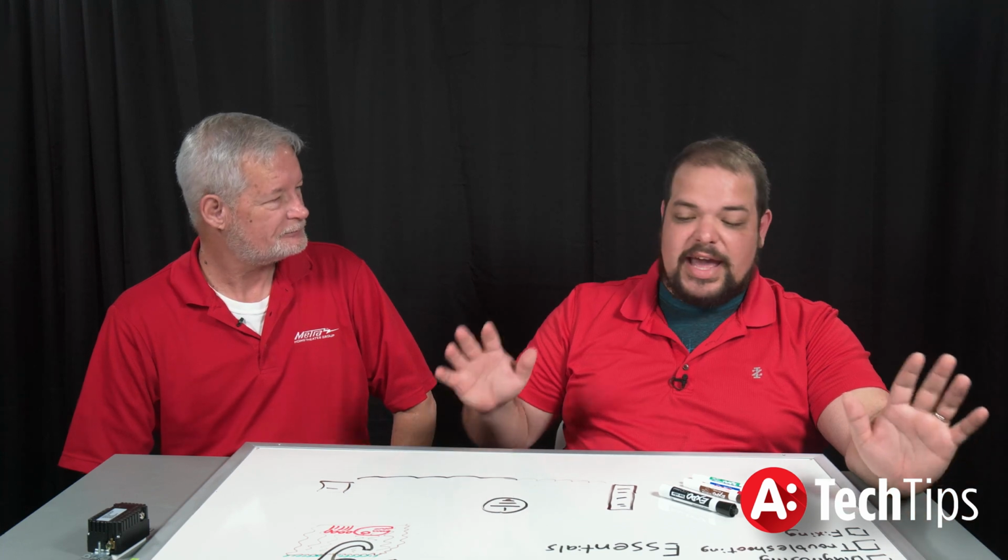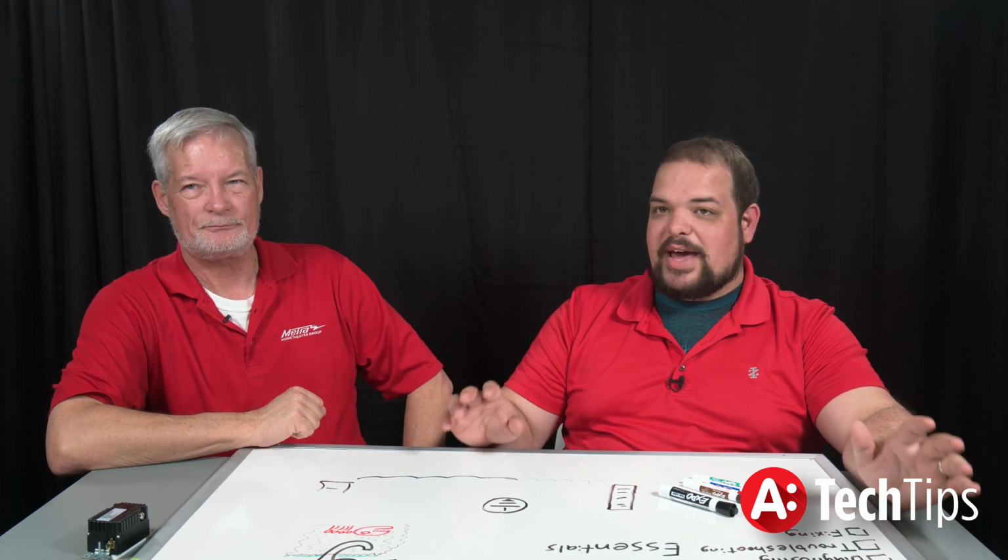Now, you and Rob will probably get into details about what to do if you run into a house that only has a two-prong setup. It happens. We had this discussion yesterday. If you go up somewhere in the northeast, the older houses have two-prong setups, and you guys will get into more detail about surge protectors that are nominal at that point. Granted, you can use things like an MOV surge suppression, which is absorptive. It absorbs it, it's not going to shunt it somewhere. And then of course you'll talk about the newer houses. Anything else that's $12 and claims to be a surge protector is not, because there's no absorption in those.